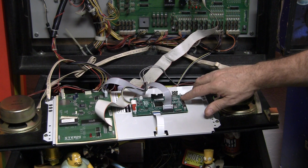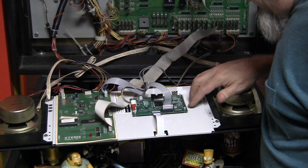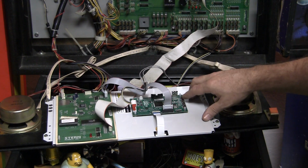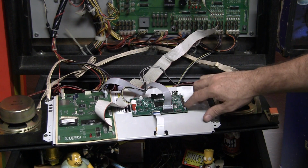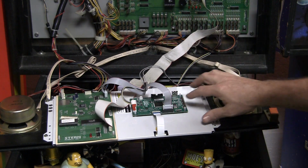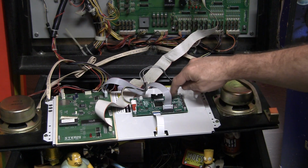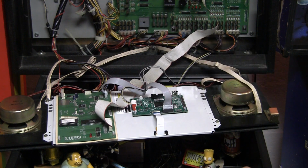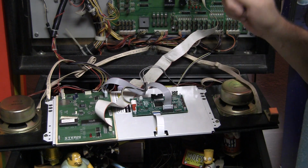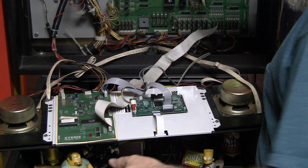and you'll see there's 4 buttons over here. One's labeled USB, select, up, down, and menu. You want to press the USB button once you've got the game started and the USB is in there. Press and hold that down. There's a few lights here that'll blink for about 30 seconds, and then they'll go dim, and then the thing should reboot with the new ROM on. You can pull the USB out, and you're good to go.